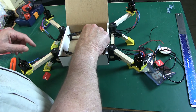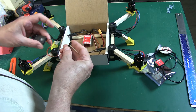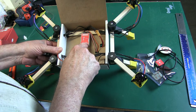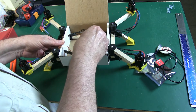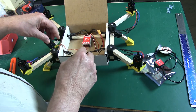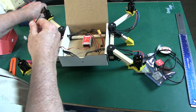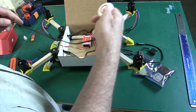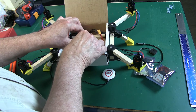We're going to trim up all the wiring a little bit later. This is super easy to install. The ground is on top — power is in the middle, signal at the bottom. X3 is where we're going to put the power, and ground is on top. Signal is at the bottom — we're going to put a power lead on here and actually put a plug so it plugs in. The GPS goes in one way and it's going to go here on the top.